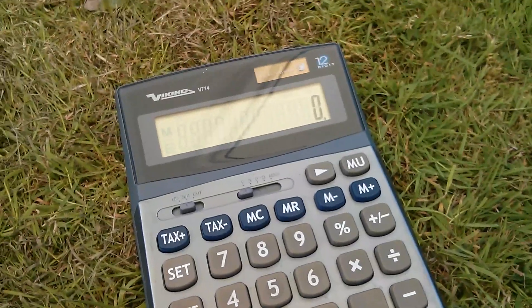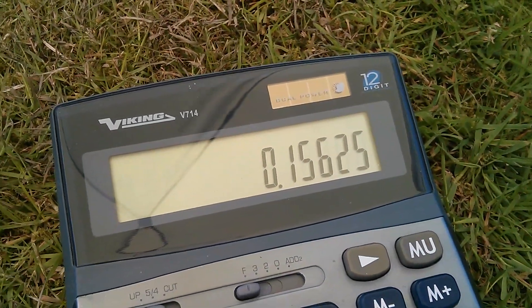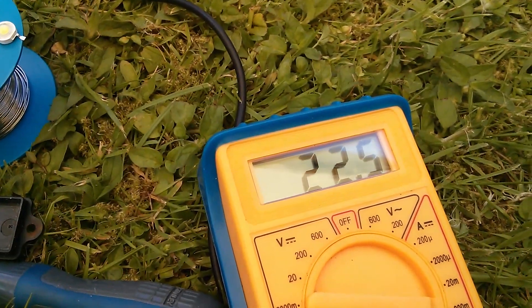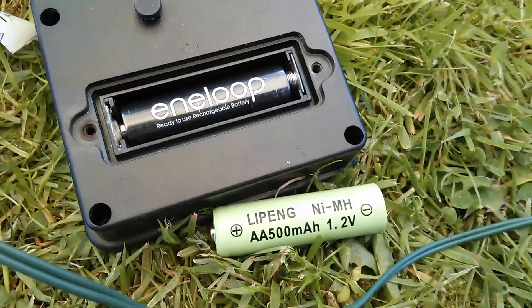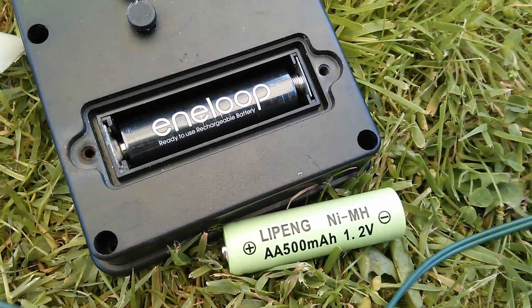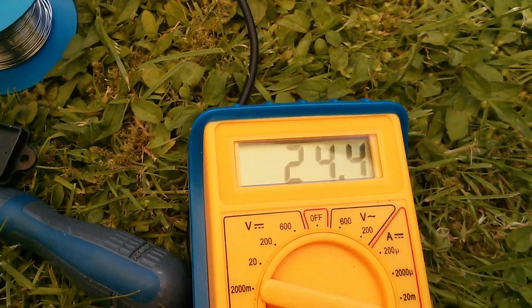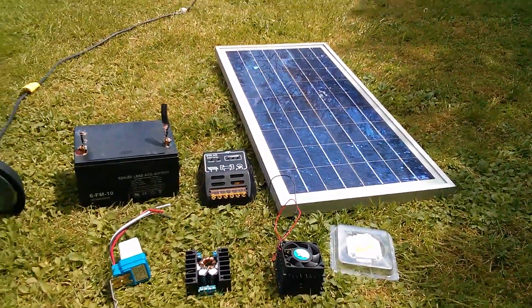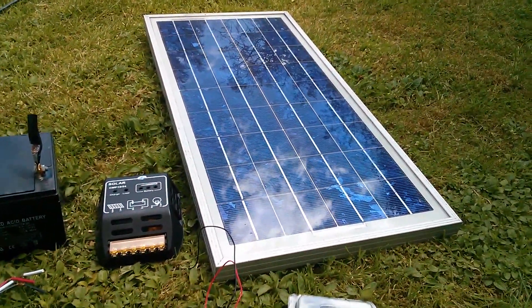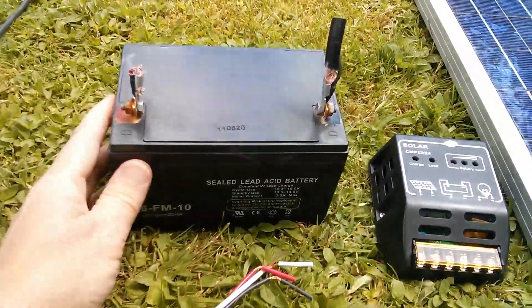I know when I'm beat. This isn't going to work — I'm certainly not going to get half a watt. Half a watt divided by 3.2 volts means I should be looking at 150 milliamps, but I'm only getting 25 milliamps when I cover the solar panel. Just in case it was the poor battery failing me, I've put in a tasty Eneloop cell — LEDs on, 25 milliamps. It's not going to work. All those fancy numbers — 0.256 watts, 0.064 watts per LED — are just a load of old rubbish.